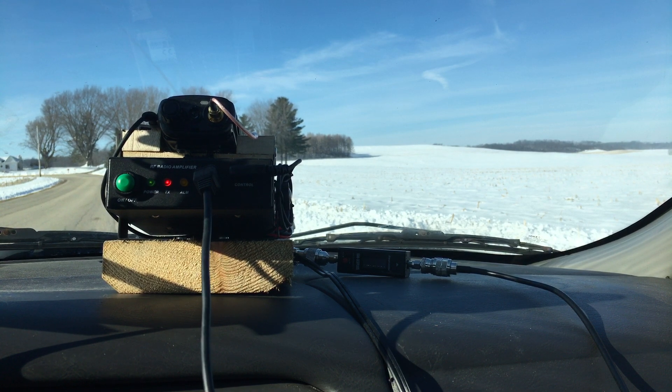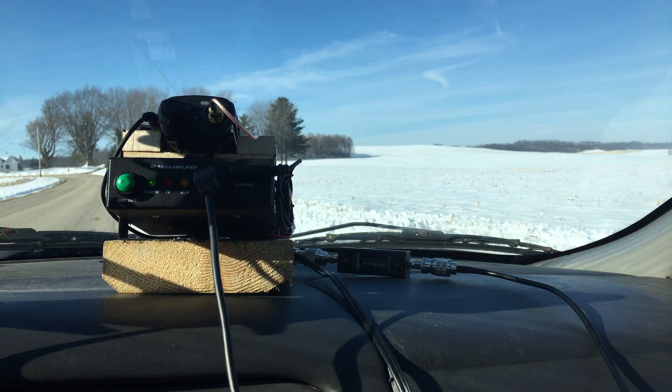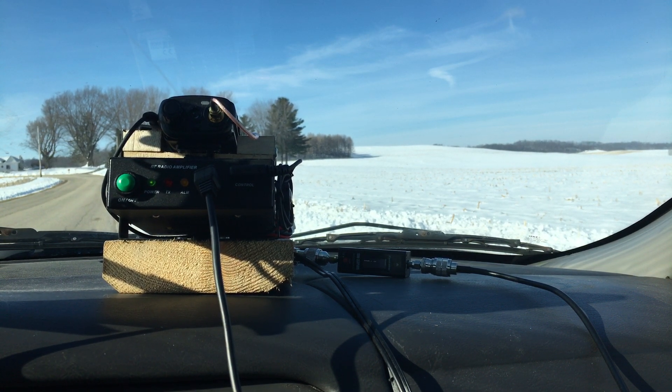We hooked the antenna back up to the handheld and amplifier. Radio check 1, 2, 3, 4, 4, 3, 2, 1 — same location, 3.19 miles away. We're getting 1.55 SWR, 27.7 watts. It's sounding pretty good, actually. What's funny is this is the second video I did. With my homemade antenna it's actually sounding better than the antenna that came with the magnet mount.